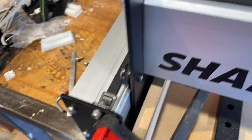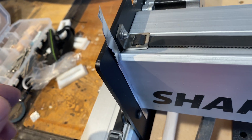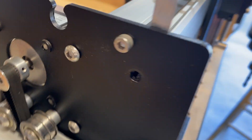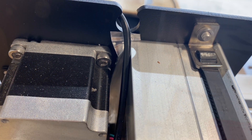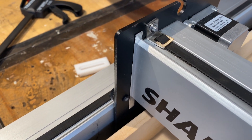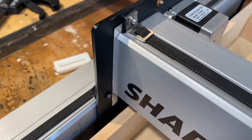I'm going to attach my clamp and hold that gap open so that I can insert some shims. I'm just using aluminum foil — I think I needed six layers of aluminum foil to get the gap closed. You want to make sure you space evenly left to right. On the right side I had six shims, on the left I had six shims, and that makes sure that the stress is distributed equally on both sides.